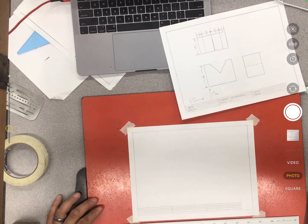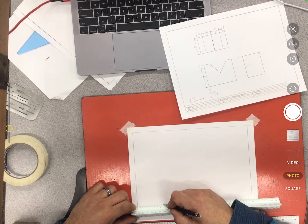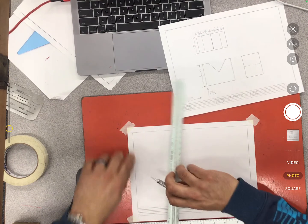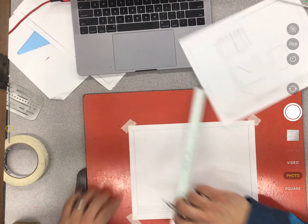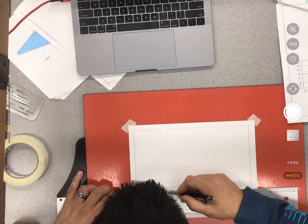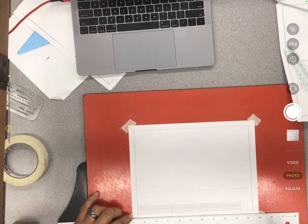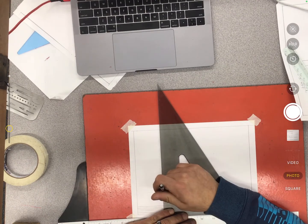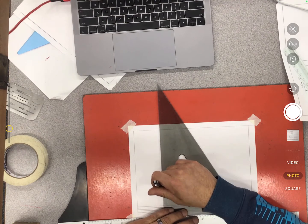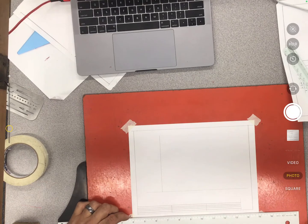After you have completed your title block, let's find your start point. Your start point is going to be 2 1/4 over, like we said. It has to be 1 3/16 up. Hit your 1 3/16. Draw yourself a nice horizontal line. That's your 2 1/4. You can draw your vertical line. You can start down here, but I like to start right at the start point instead. That way I have less lines to erase.